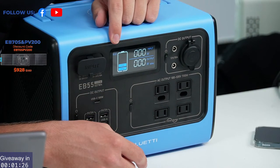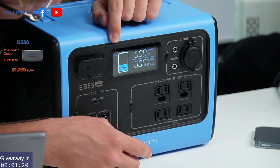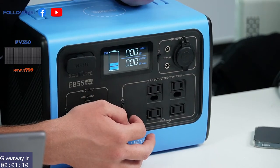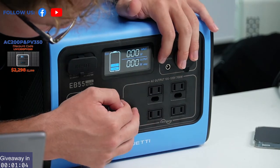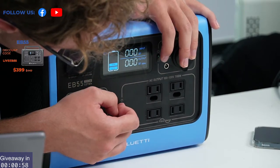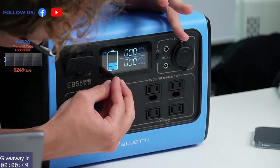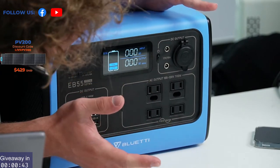Eco mode turns off the AC inverter in 4 hours if there is no load or the load is very low. It does so to save the battery. And we also have frequency here, it's standard 60 hertz in America. And if we have any alerts like overload, overheat, temperature high, temperature low, short circuit, and any other alerts, you will see them in red right here, okay? Now also, when we turn AC on and DC on, the screen will stay on longer. In other cases, guys, it will turn off quite quickly. So 30 seconds max. Okay, we did it so that we can save the battery because the screen draws down the battery. So I hope you don't mind that too much.